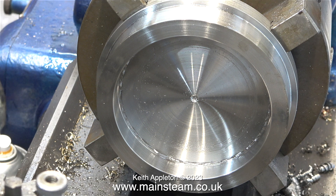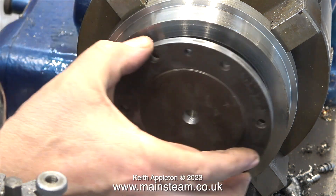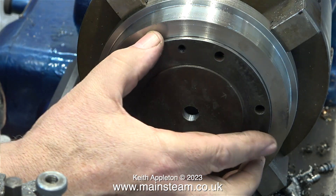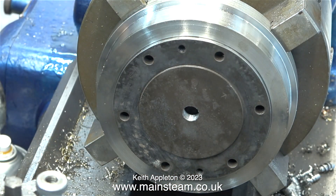After quite a while, the recess was starting to develop — not quite deep enough, but nevertheless I can do a test fit with the cylinder cover. I've cleaned the paint off round the outside edge. And I'm afraid this is me at my most stupid, making a total beginner's error. The cylinder cover wasn't really a tight fit in the recess, just a firm fit, but the minute that the cover went in, the outer part of the stainless steel started to shrink and grabbed it.